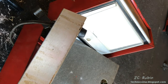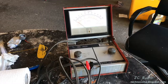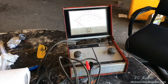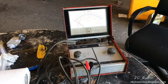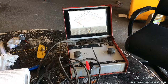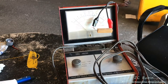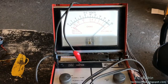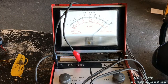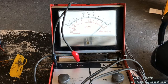Back at the bench — we're going to take this unit, reassemble it, clean it up and install it back. This is going to be the last piece we're installing. The unit is now cleaned up and reassembled. We're going to run one more test — throw a resistor on and make sure everything is okay, then put it back into the complete test set. We can see this 50-ohm resistor is now reading 50 ohms correctly on the x1 scale, and on the x100 scale it's correctly reading 0.5. Voltage and resistance are working.